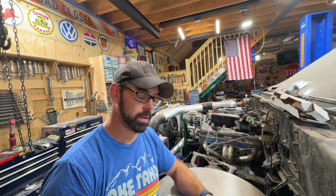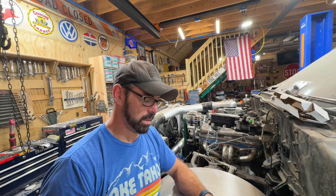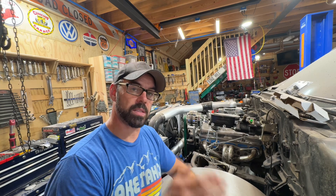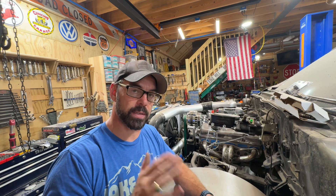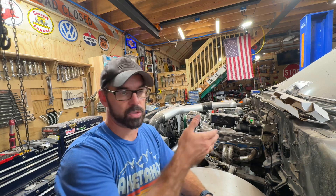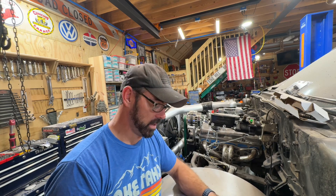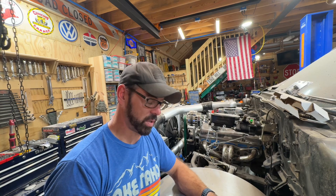This was really one of the main things I wanted it for — I want to try it with welding body panels on the car. So far it's pretty nice, very easy, very intuitive to use — you're just pointing a laser and making it go. The biggest problem it solves is that when you're welding with a MIG or a TIG, the arc tends to wander, and you're always trying to keep control of that arc through intensity with the TIG pedal or how you've got your MIG set up, how you're moving your hand, how clean the tip is, how clean the surface is. It's not particularly easy, especially when your surface is very irregular, like a car. So I'm still going to use MIG, and I might continue to try TIG, but this makes me say for aluminum, I don't need TIG. And that's quite a thing — pretty happy with that purchase.